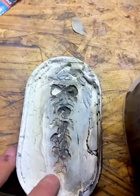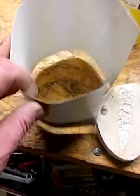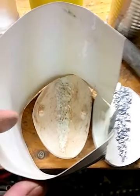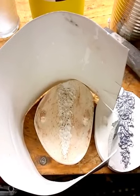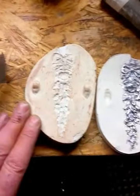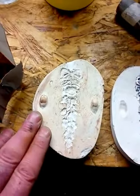So I got a base of clay and did the first part. I used some aluminum flashing and molded it around the clay, then put my piece in it. I mixed up my plaster — it's like two parts plaster to one part water — just did about a half a cup, and it formed this first piece. Then I soaked it using some Murphy's Oil Soap and let that set up. It only took about 30 minutes to set up, which surprised me.